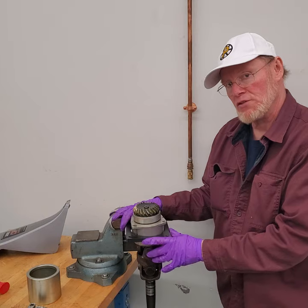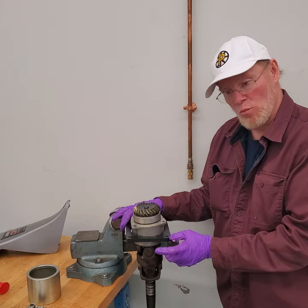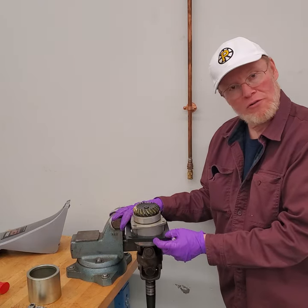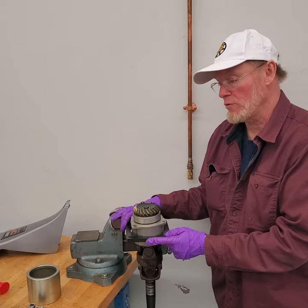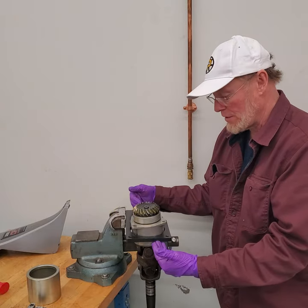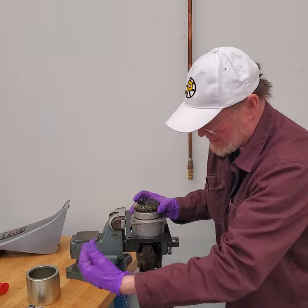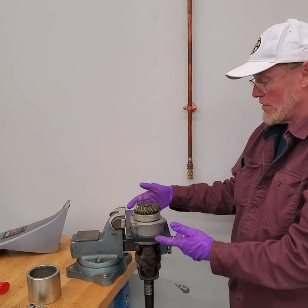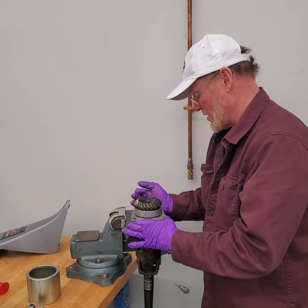There's a fixture tool here — it's an older fixture tool, not in the book. There's one very similar for the new DPSA. This was made back in the DPA or earlier drives, maybe the 280 or 270. The part number, if you want to write it in your service manual, is 384-9658. If the dealership has one, clamp it into a vise. It doesn't fit perfect, but there are slots on both sides and a recess that originally would fit down so you could bolt it in position. You could modify it if you wanted to, but I don't see any reason why you would.